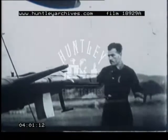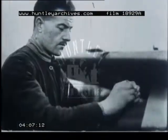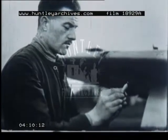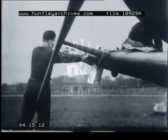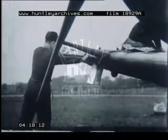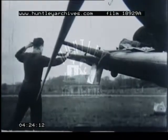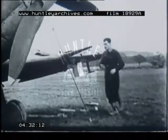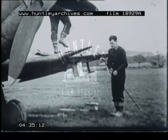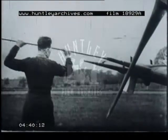It must always be remembered that the turning round of fighter aircraft is an operational measure and must not be confused with, or substituted for, normal inspection and maintenance. For example, the armourer's assistant using his cleaning rod on those machine guns knows he is not removing all the fouling from the barrels, and that when the aircraft is released from operations, all those barrels and the recoiling portions will have to be removed for thorough cleaning and inspection. However, by using his cleaning rod, he is removing a certain amount of fouling which is easy to shift now but much harder to remove if left till the end of the day. He is also ensuring beyond doubt that there is no obstruction in any of the barrels.